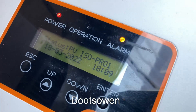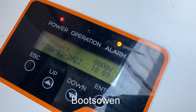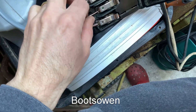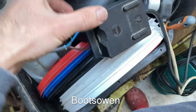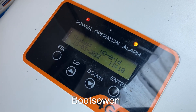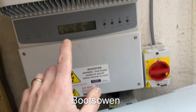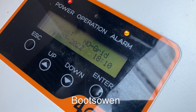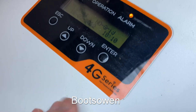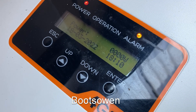Almost immediately after I turned off the camera, it had PV ISO PR01 — that's the 01 error for negative to earth leak. So let's just try disconnecting this earth, because that was suggested as an option and it only takes a few seconds to do. So I've got no grid but that should come back on in about 20 or 30 seconds like before. The logic I'm trying to apply is that my solar string works fine because this machine should detect any errors also — that's one kind of trial-and-error way of testing. When you look at the troubleshooting for this, you have to check for an earth leak. I've got the same error — PR01. I saw it just a second ago, so disconnecting the earth hasn't fixed it.